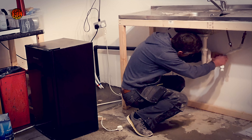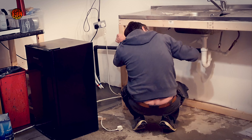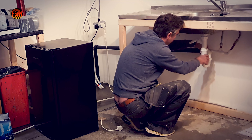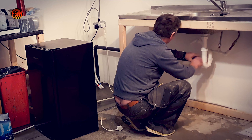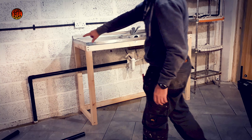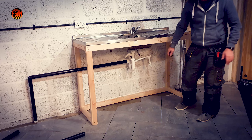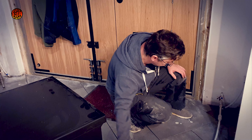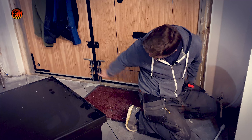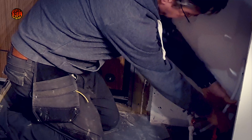You can see I've just got two cold feeds connected up to the tap — it's just a cold water tap, and I've connected both because if you just have one and turn the tap to the mixer side it gets water flowing back out the other side. Then the waste, with the dishwasher, is up there. The water feed to this is down here — this pipe is just push fit, so we undo the thread, squeeze it in and knock it out. This pipe is a compression fit on this trap, so we just undo that. I'll just leave everything connected up to the sink at this point — and that's it, disconnected.